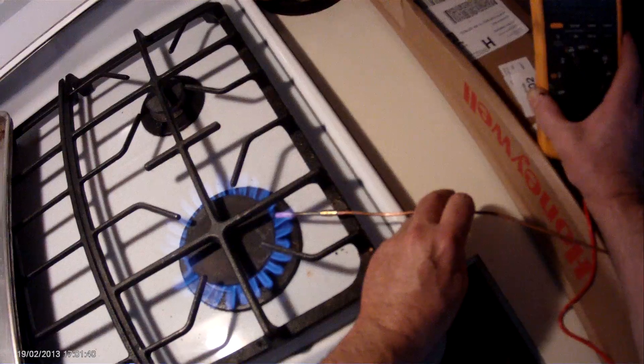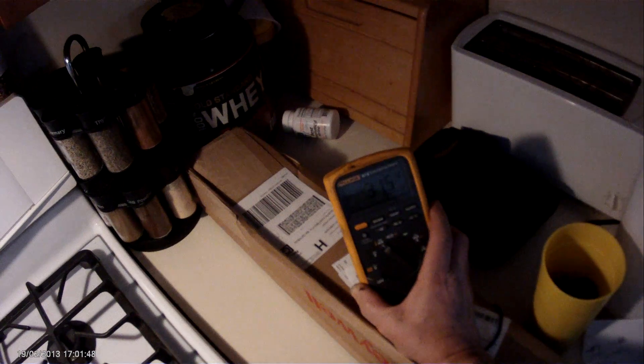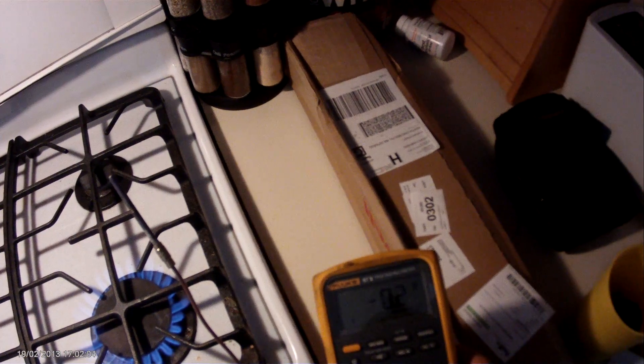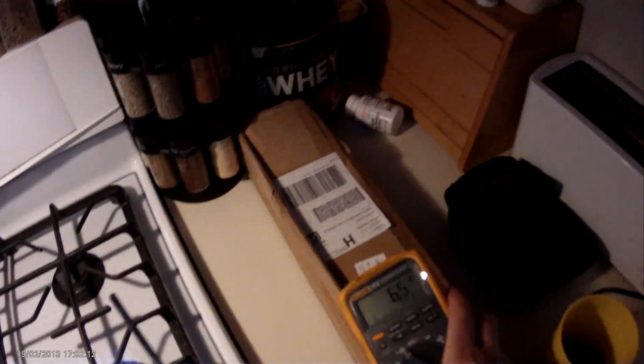See how it's red — that's usually what you'll see on there. When that flame's hitting that thing, look at that thing climb — millivolts. Now Flukes are awesome meters but they're kind of bulky. As long as you get a meter that's got the 400 scale. The Fieldpiece 36 is good too — that's usually what I carry because it's a lot thinner. So that one's good.